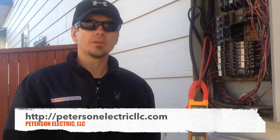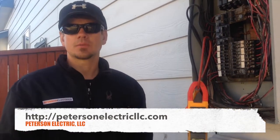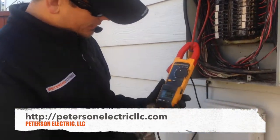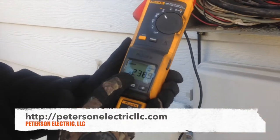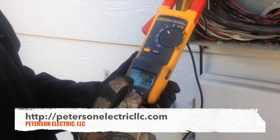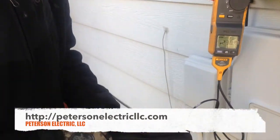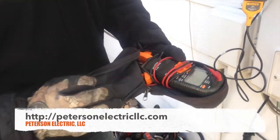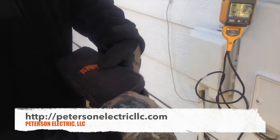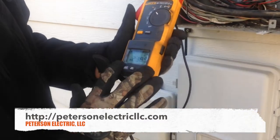I got out here and the breaker was spongy — it wouldn't reset. It was a Siemens 50-amp double-pole. What I'm seeing right here is this meter, which is a Fluke 381. It has an inrush current button and it takes a snapshot so fast that no other normal meter can do that. My Klein meter here is decent for everyday use — CAT 3, 600-volt rated, 400-amp rated — it does well for amps, voltage, and resistance, but we need deeper diagnostics to see what that compressor looks like.